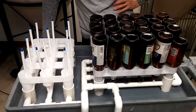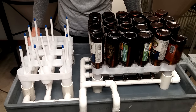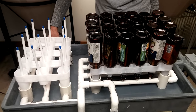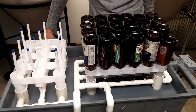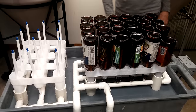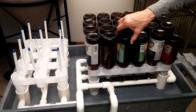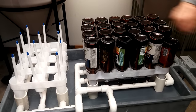I bored holes through the sides of them — you can see them on the bottom. I used a 5/8-inch hole saw bit and a drill press, but the problem is a 5/8-inch bit's a little big and it was sloppy, and we needed a really tight fit. So while that bit was on the drill press, I took a flat sander and a right-angle grinder and took the outside hook off the bit. That made the hole really snug, and it took a lot of physical effort to slide those on there. Once they're in the proper spot to receive the Fast Rack, they don't move.